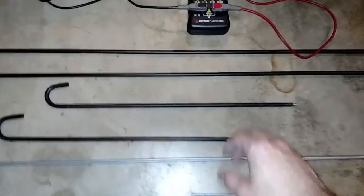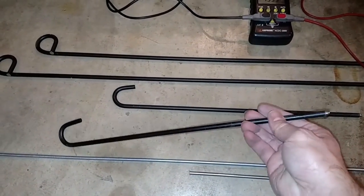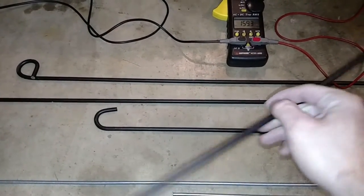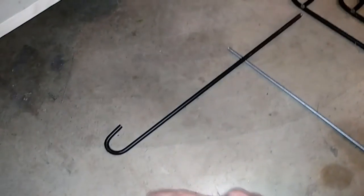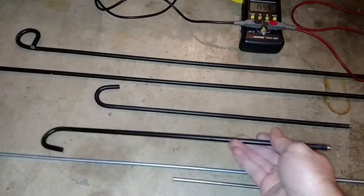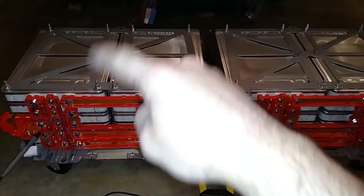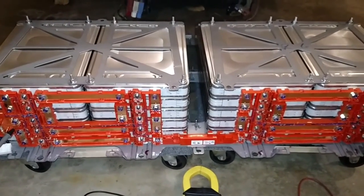These are M6 threaded rods. To align all the modules, the service manual recommends you use a 7-millimeter rod. I couldn't find 7-millimeter rod stock in the United States, so I took my caliper to the hardware store and measured things — and found some kind of plant holder that was the right size. I cut them up, sanded the edges down, and ended up with nice alignment pins. I put three of them on three corners and it lines everything up really well — you just drop the threaded rod down and put the washer and nut on.